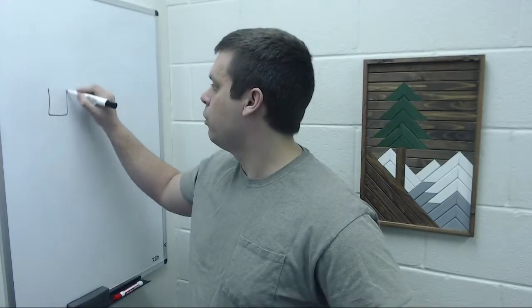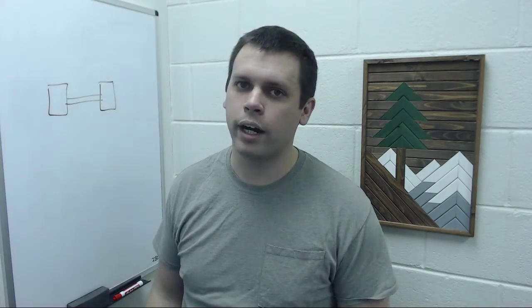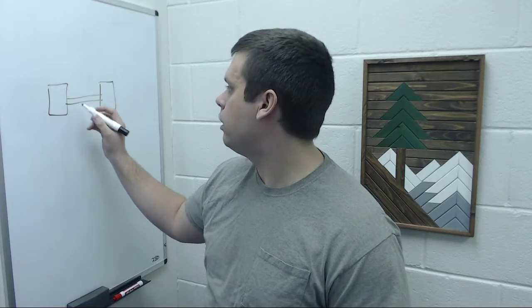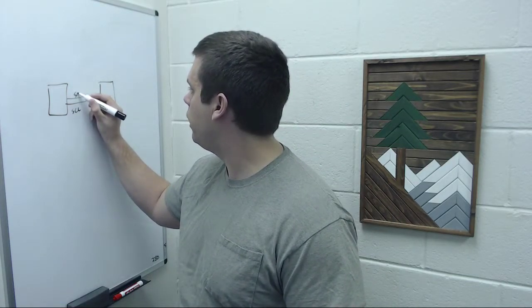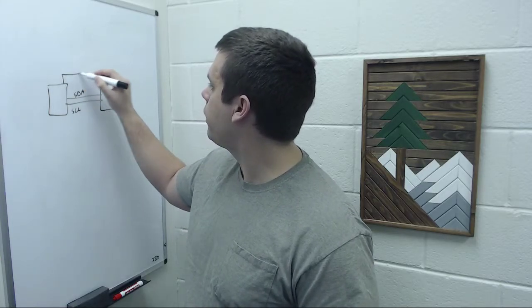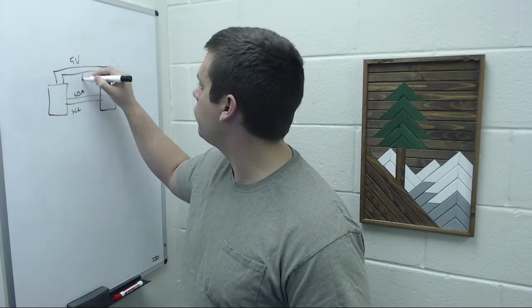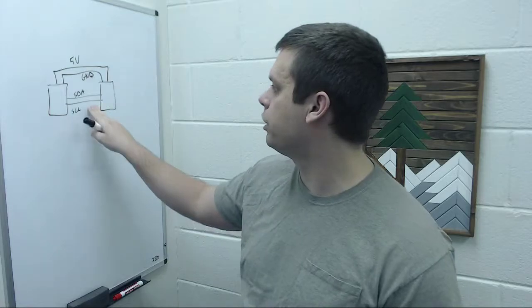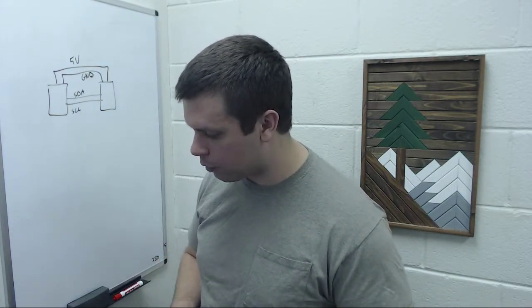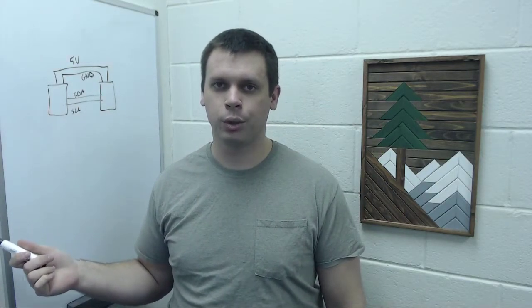You just have one Arduino over here, another Arduino over here. There's 2 wires in between. It's probably a good idea, this is SCL, SDA. Probably not a bad idea to share 5-volt and ground between the 2 of them. But you really just need SCL and SDA, and you can be up and running, communicating between 2 Arduinos.